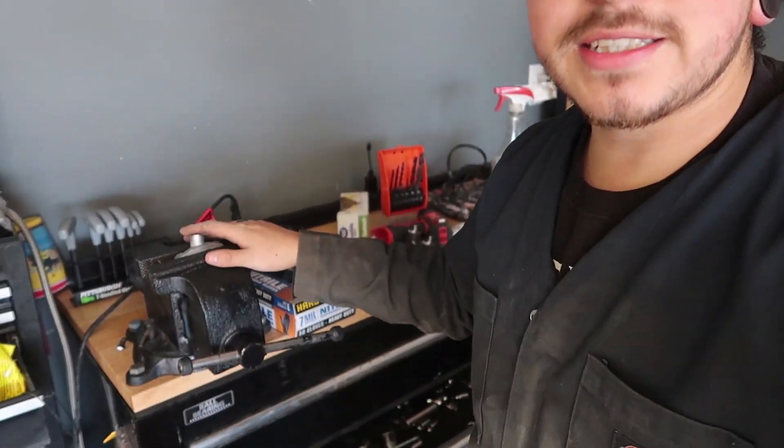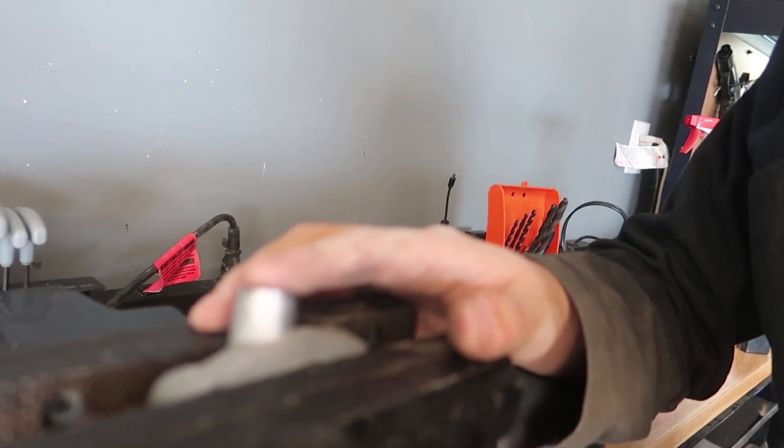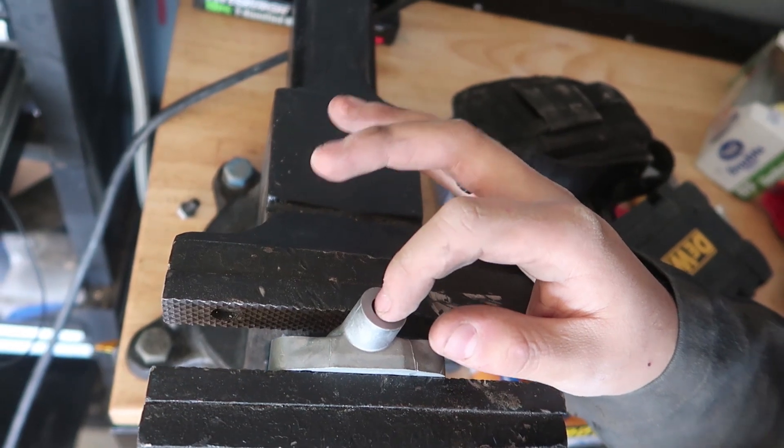What's up everyone? I'm currently working on my oil lines for my turbos on my LS motor. I'm gonna show you guys a little trick. I'm gonna use this oil cooler block off plate. I'm pretty sure every LS oil pan has one of these, and all it is is this little plate. I'm gonna drill in here a little passageway for the oil to flow through. Follow me and I'll show you guys how I'm gonna do it.